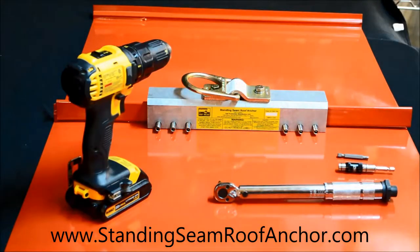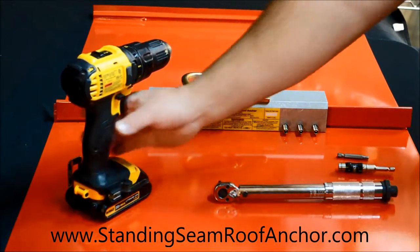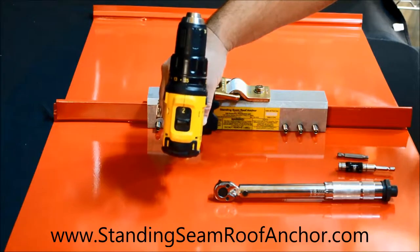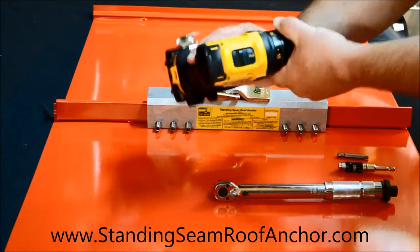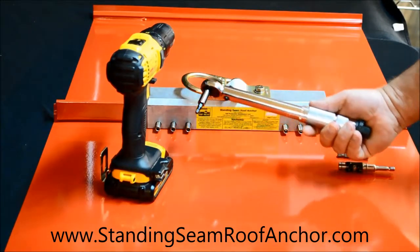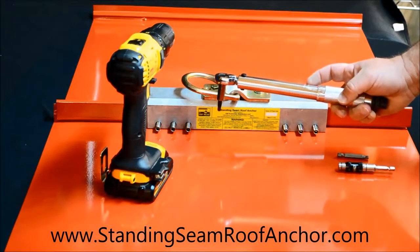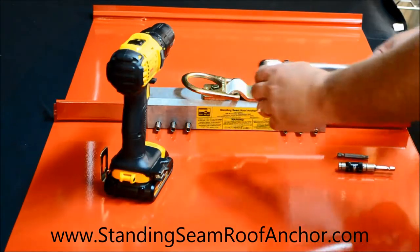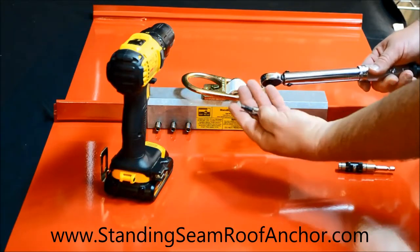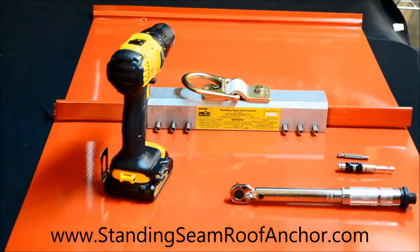So once you've done all that, you really just need two tools to install this. You need your typical screw gun. Hopefully your screw gun has a clutch, that comes in handy and certainly helps speed up the installation. And then you also need a torque wrench, what they call a micro torque wrench, that is capable of reading down into inch pounds. This is a quarter inch drive, and with this I have a quarter inch socket bit with a 3/16 inch hex. And that'll just be used for the final torquing.